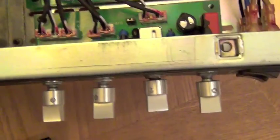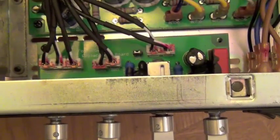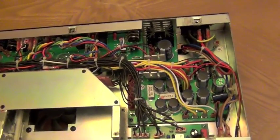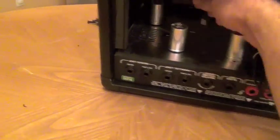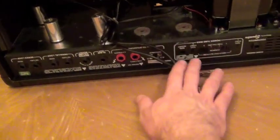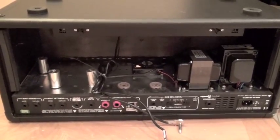My board is ready to go. This little jumper right here — when installed it gives you like a half effect — and I want the full kick and acid-ness of my Salvation, so goodbye little jumper. Once you levitate your amp back into the wood shell, remember to plug that power supply for your reverb tank back in. When you're all finished and everything is connected, it's really good to check your bias because bouncing everything around back here is going to make a mess of things. As you can see, the installation is a piece of cake and the sounds are going to blow you away.